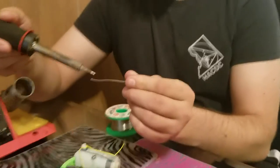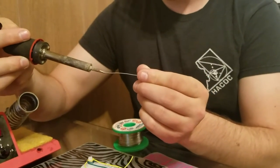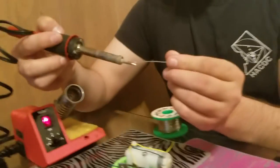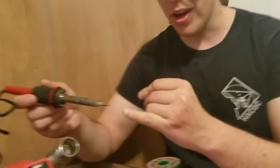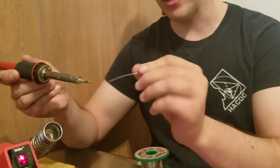Alright, so let's see if this is hot enough. Oh, it's not hot enough. Oh, yes it is. Just barely. Alright, cool. I'm figuring out that the tip is hot enough by... the tip of the soldering iron. This is a soldering iron. I'm making sure that the tip is hot enough by getting some solder and poking it in and seeing if it melts.